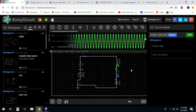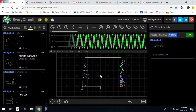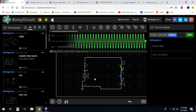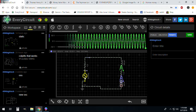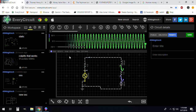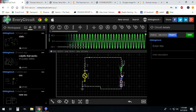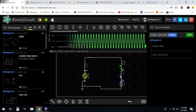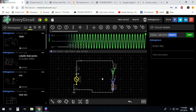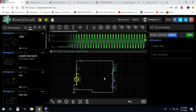Some people might think, well, that's resonance, that's how a boost converter works, or any kind of switching power supply. But this ain't free energy. That just means it's sucking more amperage out of the source. The reason it's doing that is once you hit the resonant frequency, the reactance and the resistance disappear, and basically the inertia of movement overrides the resistance and the reactance. When it's AC you call it reactance, but it's resistance.